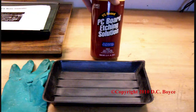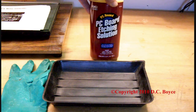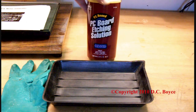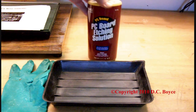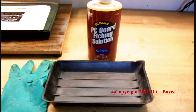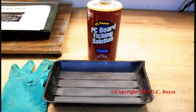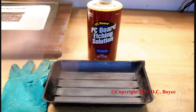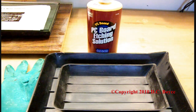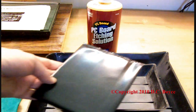In order to etch the board you're going to need some ferric chloride or ammonium persulfate crystals. I'm going to use ferric chloride — that's all I ever use. This is made by GC Electronics and the part number is 22-238. It's a one liter bottle. You'll also need a tray to put the etching solution in, and possibly another larger tray to go underneath, a glove, a roll of masking tape, and your circuit board.